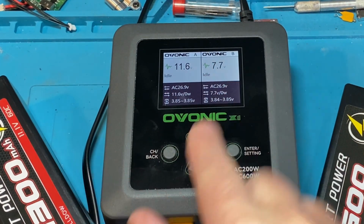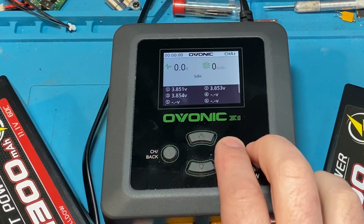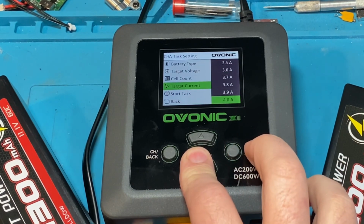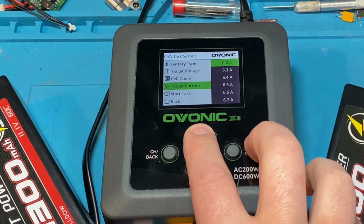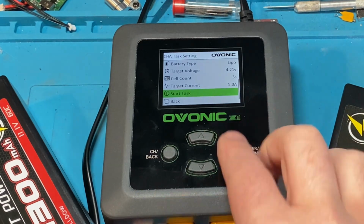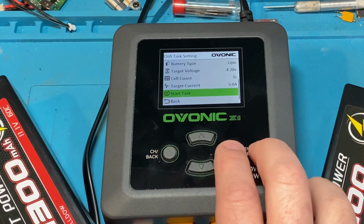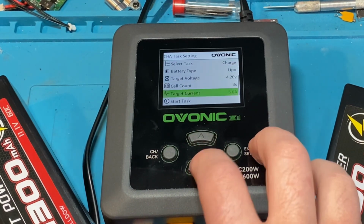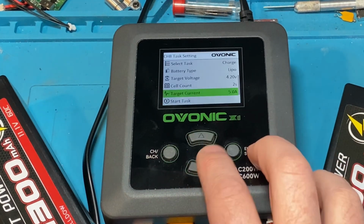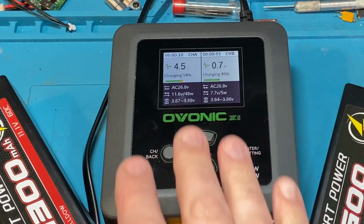So we've got the 3S over here, the 2S over here. Let's go ahead and go into our 3S. You can see each of our cells. Okay, well, let's just start a charge on this. Target current's going to be, we'll do 5 amps. It automatically detects if it's a 2S or 3S or 4S. We'll put our target voltage back down to 4.2. And we're on charge. Yep. So we'll start that one. Let's go over to our channel B here, and we'll do the same thing. 2S, 5 amp, good to go. Start charge.